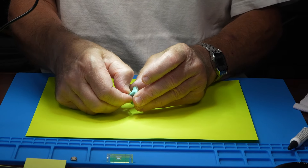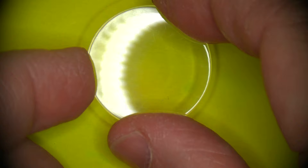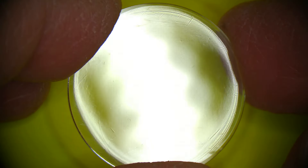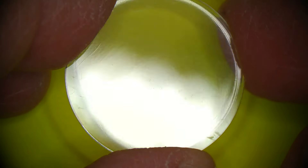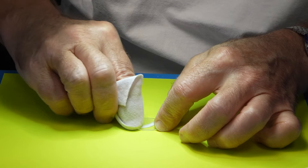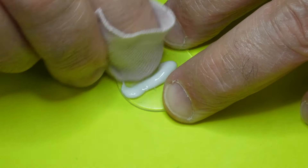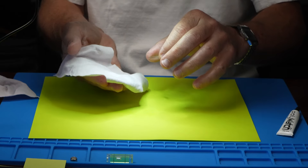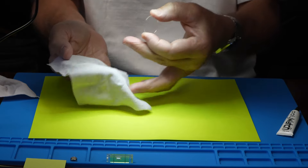We'll give the crystal a final cleanup and then get this watch back together. Looking at the top side of the crystal, I think it came out very well. The center looks very clear. I may try to do some Polywatch on the underside of the crystal — looks like there's a scuff. Polywatch is addictive; once you start you just don't want to stop. One more application on the face, paying attention to those edges. I'm going to rinse this, give it a final buff, and we'll be ready to re-case the watch.